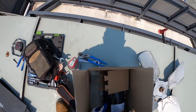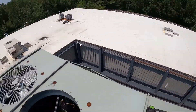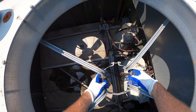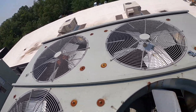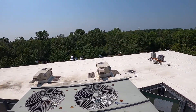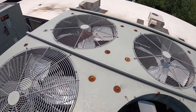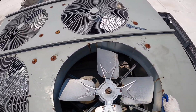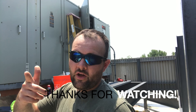I've got the new motor here. Sometimes it's going to be a little pain in the ass the way these mounts work. I got the motor all mounted up — I just like to give it a check on height and compare it with the other ones, make sure it's in the fan shroud properly. I like to give it a good spin to make sure nothing's hitting, then go slow and make sure my gap is very consistent all around each side. It looks pretty good. All four condenser fan motors are back on, all three compressors are running, and the system's running at 100% — it's going to need it today, it's getting hot out here. I'm not sure where I'm headed next, but if I've got something good I'll be bringing another one to you. See you in the next one.